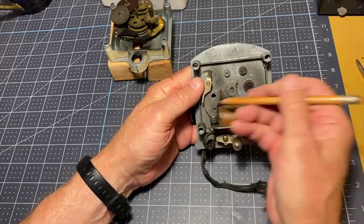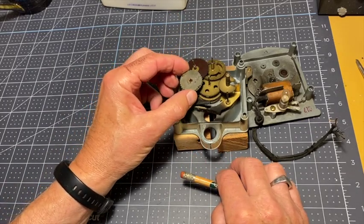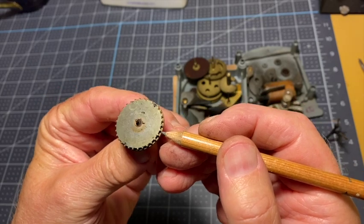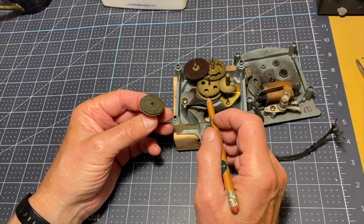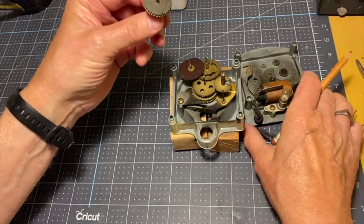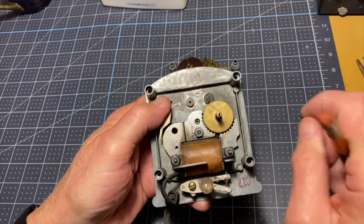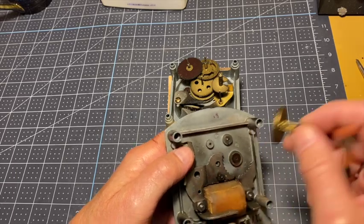As they ratchet back and forth they change their polarity, and the clock mechanism itself is this special gear right here. You'll notice that the gear itself, although it's toothed, it's square cut — those are square teeth, not normal gear teeth. As this gear sits right in between these two poles switching back and forth from north to south, that causes this thing to move. This is the motor. This is the rotor for the motor.